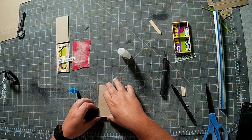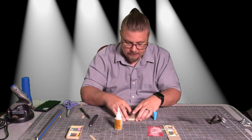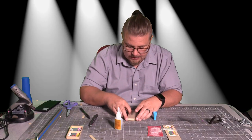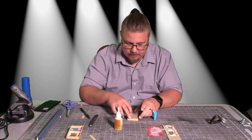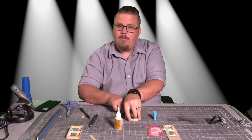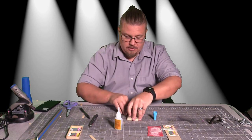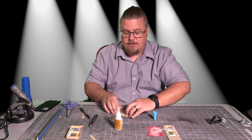You'll measure corner to corner to ensure that your flat is square. Now is the best time to square up anything that might be out of alignment before you staple on the front cover. Again, if I have any overhang, I'll use a router and smooth the edges so that if I have to put it next to another flat, there's not any gaps.